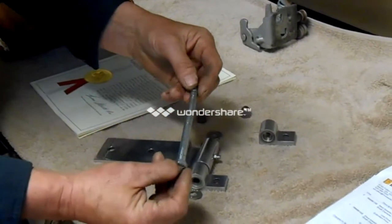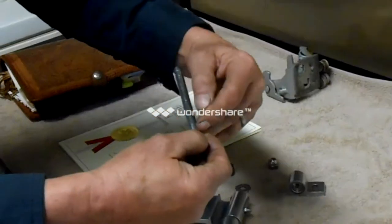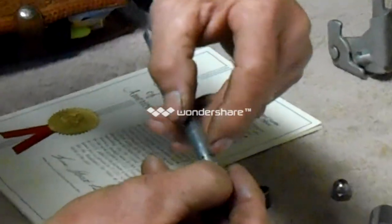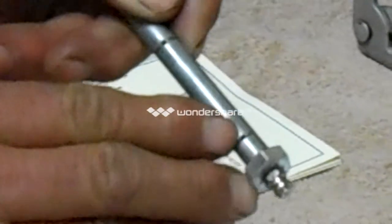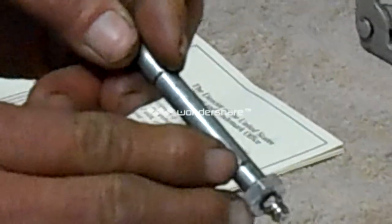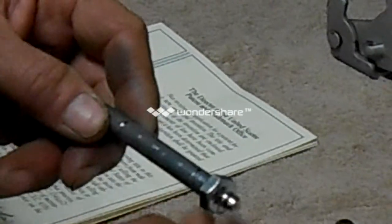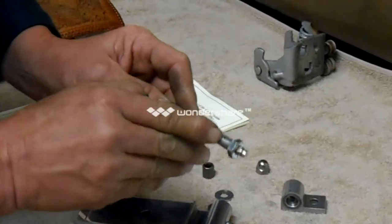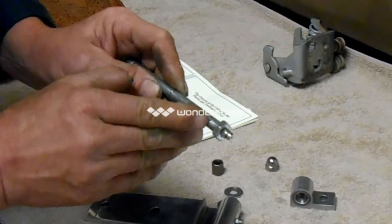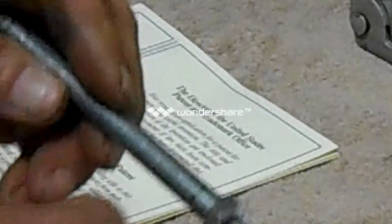This application here has a pin, and if you'll notice real close, there is a groove around this bolt, and in that groove there is a hole that goes all the way through to the other side. That is because grease comes through this grease fitting, comes out of these two holes, and travels around that little shim that's around it.